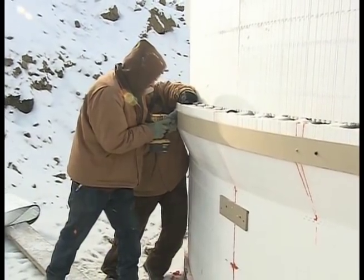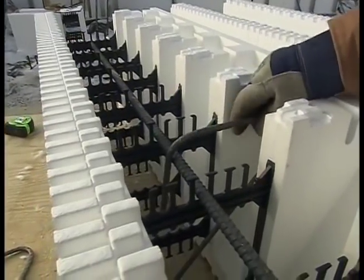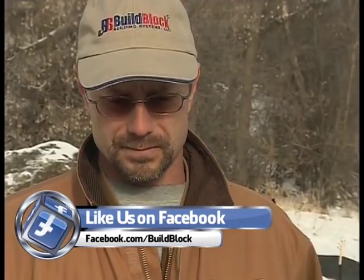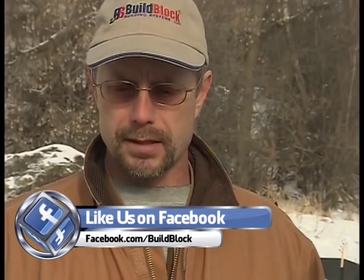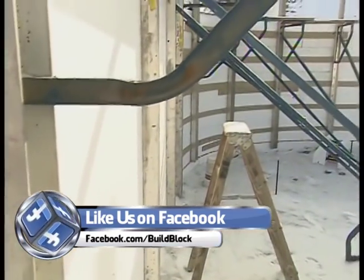One special part we're using is a stone ledge around parts of this — the stone or brick ledge form adds four inches of bearing for brick or stone to sit on, and there's added reinforcement for that brick ledge. We had these custom bent so they're all set to go right into the opening — they hook onto the existing horizontal rebar with no additional time.